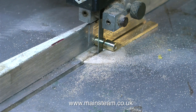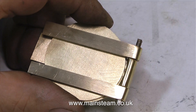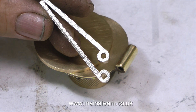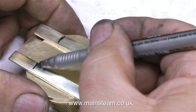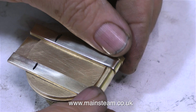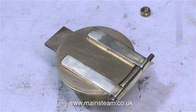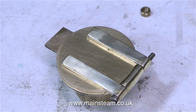I'm using a piece of wood here to push the last part through the blade. With both hinges temporarily fitted to the firehole door mounting, I use my 1-inch belt sander to finally grind the edges to shape — and as you can see, they're much more even. I'm marking out with a felt tip pen how long I want these hinges to be, then taking them to the bandsaw to chop them to length. With the nut and bolt securely tightened, I took the part to the belt sander for the final adjustment, grinding the middle part and the hinges to the same shape. Now the hinges and the mounting are exactly the same shape — just the way I wanted it to look in the first place.